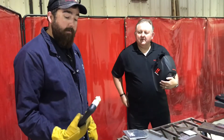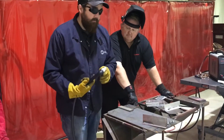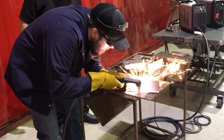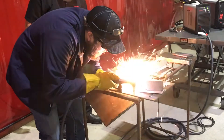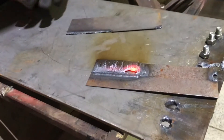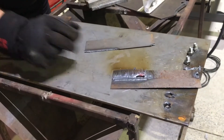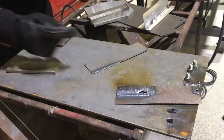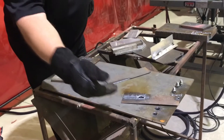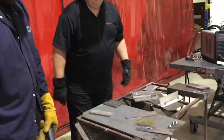Pretty simple to use. We're going to flush cut this weld off this little T-joint that we have here. Perfect — cut right through that weld. Look at this — this is what you want to look at when you're done. Now this is a real thin material so all this stuff here comes right off, and you're fairly flush to the plate. Normally you're going to be cutting thicker material so you won't be going through a plate like that. But you got the speed right and once you got it done you cut it flush — absolutely, very little damage to the plate.